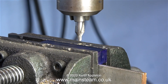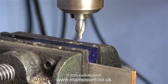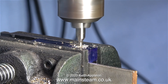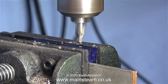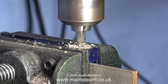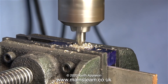Over now to the drilling machine. I'll apologize in advance for it wobbling about — I really must bolt it to the floor. For now I'll put my foot on the base to stabilize it. The usual process: first drill the hole exactly on the mark using a center drill. Center drills are good because they do not wobble about, and in the early stages if you drill the hole slightly off you can correct it with a center drill. I've sped up this simple sequence to help prevent any viewers from slipping into a coma.